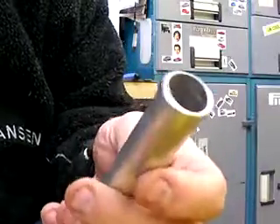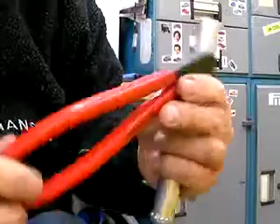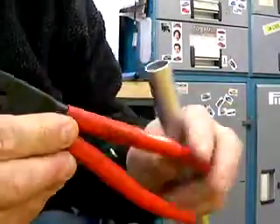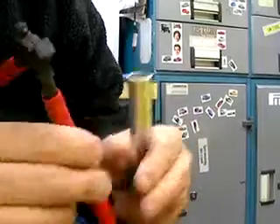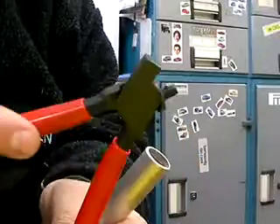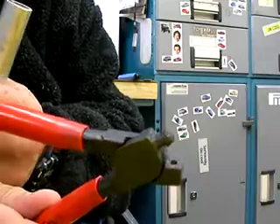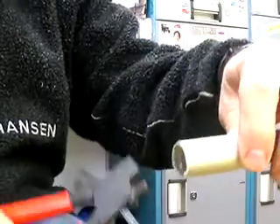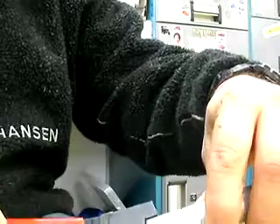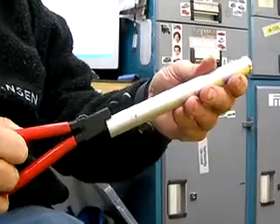How to do low-cost beading. We've got a scrap piece of pipe here and we've got the tool. The tool is basically an oyster tool from B&Q, about 12 quid — you find it in the plumbing section. On one side it has a pin and on the other side it's got a hole. What you do is go along and work your way around it.